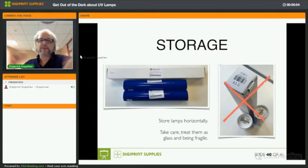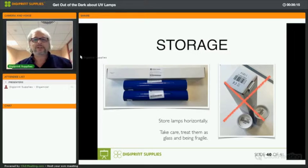So you shake it for about 5 minutes, and if it's a lamp with long wires, you need to hold the wires as well. Otherwise, the wires might start to hit the quartz body of the lamp. So you shake it very roughly, but still taking care. I know it's a bit tricky. And then you install the lamp.